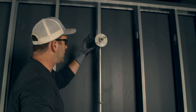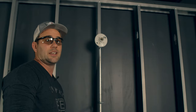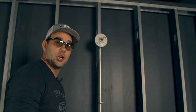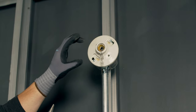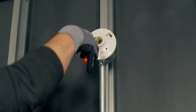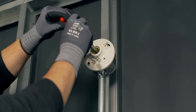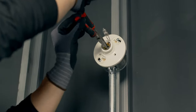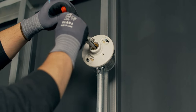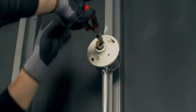So that was pretty self-explanatory. If there's enough glass that you can twist it with your hands, by all means twist it with your hands — but be very, very cautious of cutting your fingers, and wear work gloves. Before you get into the area, you're going to want to sweep up all the broken glass. Don't say you're wearing slippers or shoes — take the time to sweep up the glass because you could cut your feet. If you've got to use your needle nose pliers, you can stick them in the hole, grab both sides, pull them apart, and twist. Stick it in the hole, pull it apart and twist — see how it's coming out? Once it gets to a certain level, grab the outside and twist.